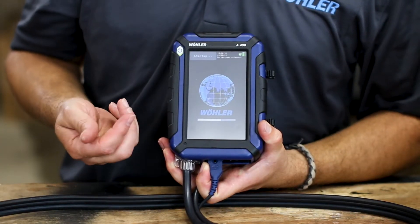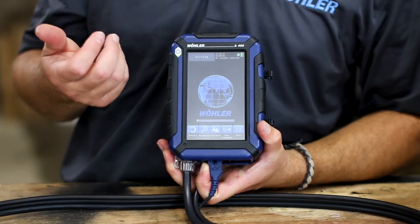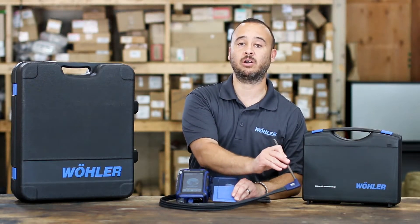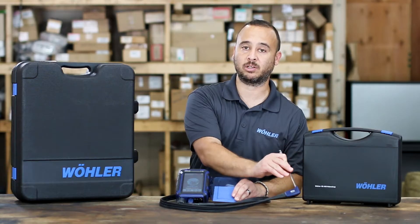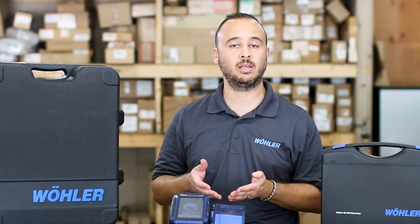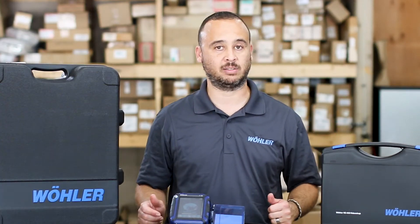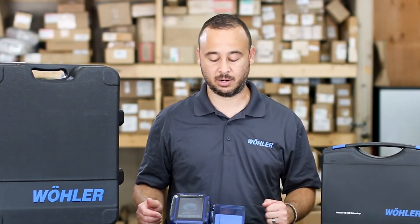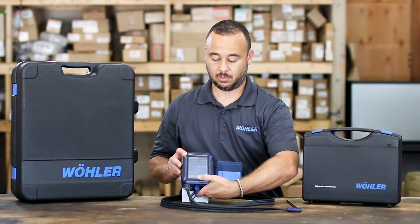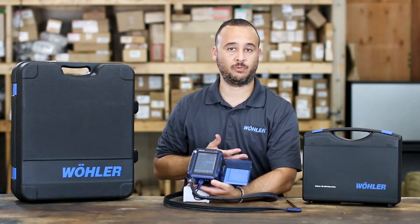Once the power sequence comes on, you'll begin to notice a timing or status bar. This indicates it's zeroing. While the pump is running, it's getting a measure and reading of the atmosphere it's in. This lets it zero and balance itself so you can start a new service or inspection process. Before you do this, make sure the equipment has been in the ambient temperature area for a minimum of 10 to 15 minutes so it doesn't receive any false readings of temperature or gases in the air. Once the A450 is done zeroing out, you can turn the pump off — this reduces wear and tear and increases battery life.